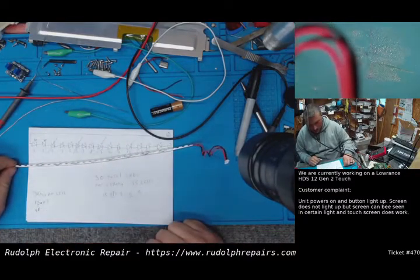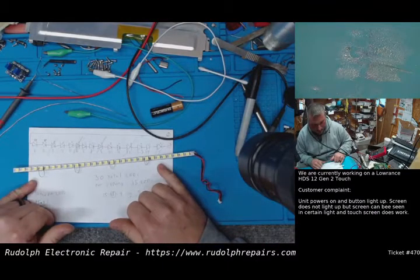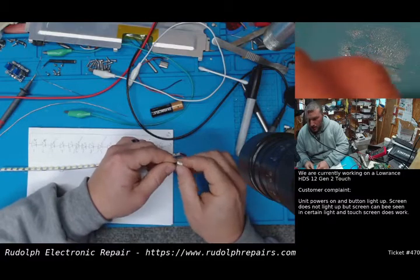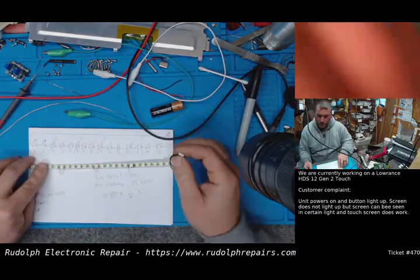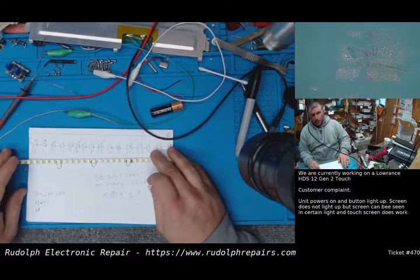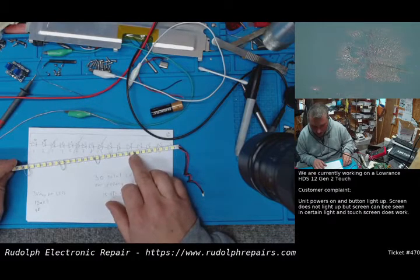Okay, good. So 1, 2, 3, 4. Perfect. We're going to go ahead and short these four LEDs. And then we're going to clip off this connector here. We're going to connect or short the grounds and the positives. And then we're going to try, with the bench power supply at 30 volts, to power this whole entire LED strip and see where we're at. If this looks good and works okay, we're going to take these jumpers out, and actually I think we're just going to go ahead and remove the LEDs and short them.